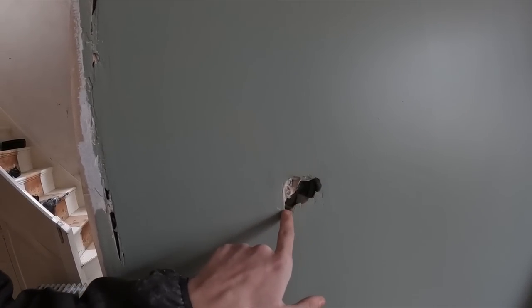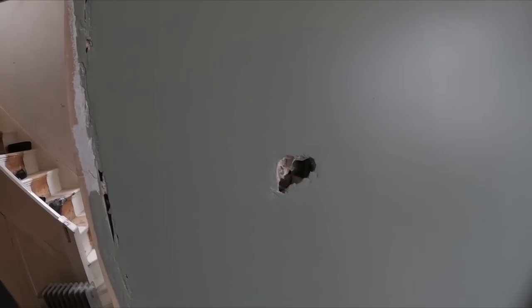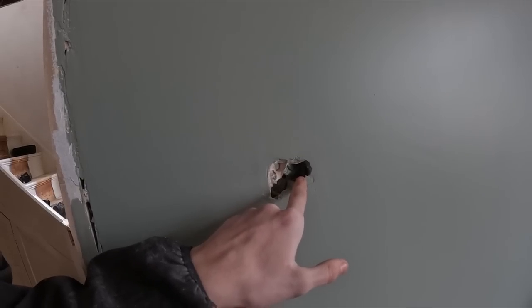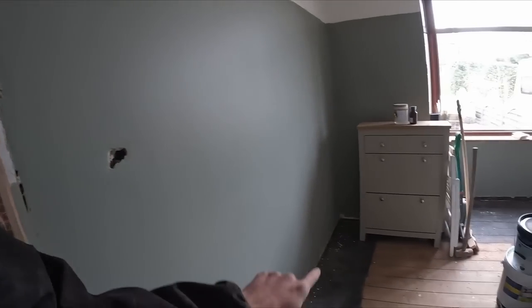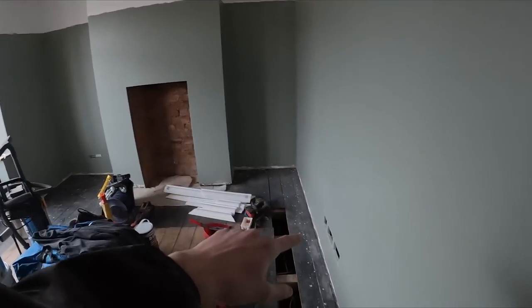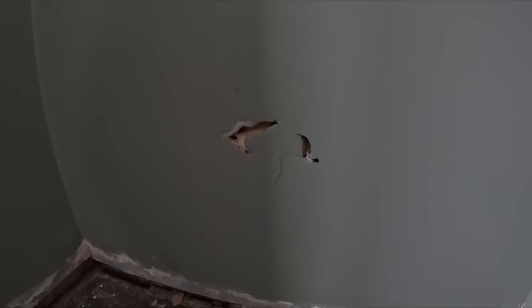You can see he's plastered over it. Realistically, the plasterer could have spent 20 seconds when the plaster was nice and wet, just run his finger around it and it would have been perfect. Now I've got to chop that out with the multi-tool, or hammer and tap it with my screwdriver to get a clean edge around the corner without it chipping. I've got to do that on one, two — there's one behind there — three, four, five, and I've had to cut these two out already.